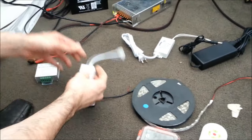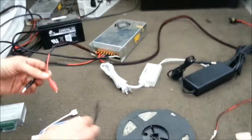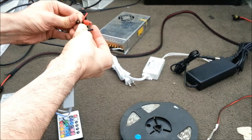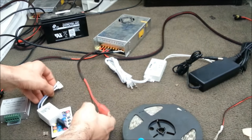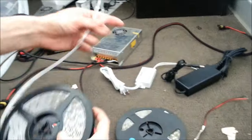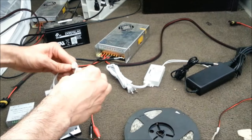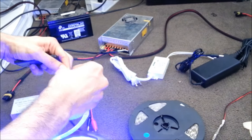You may get either one of these power supplies depending on the kit you purchase. We're going to show you on our large power supply here with the output wire, V+. Basically, you connect the power connections — make sure they're not reverse polarity, plus to plus. Plus is usually either white or red; black is ground. This is the same procedure for a battery. Your LED strip usually will have a connector. A pin might be included in your kit which you would insert. Simply connect. If the light does not turn on, you can always flip the connector around.